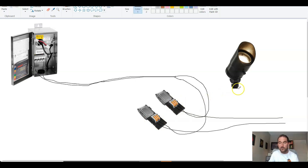So now you've filled two out of the three holes. Where does the other one come from? Well, your landscape lighting fixture is also going to have two wires coming off of it, and each one of those wires is going to go into one of those connectors. So you've got your 12-2 wire going into each connector, your 12-2 wire going out to each connector, and your landscape lighting fixture wires going into each connector — so every fixture is going to have two of these connectors.